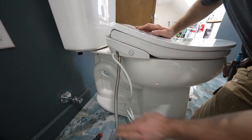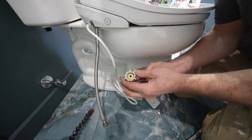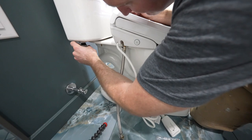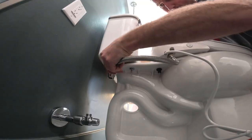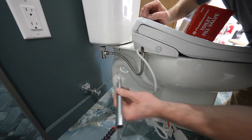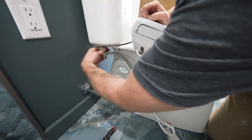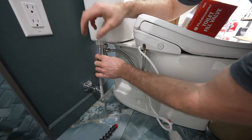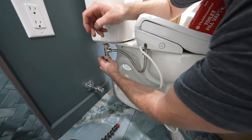What really makes it easy is this little T-valve. It's just like a regular supply valve to your toilet and doesn't require any Teflon tape — you can just thread it on like any regular valve. Hide this back underneath and go to hand tight, about a half turn past hand tight. You don't want to over-tighten these grommets. It does come with a 20-inch supply line, but as you can see, that's ridiculously long. I have another one that's just going to connect straight here. It has a little rubber grommet, so all I have to do is thread it on like a regular toilet supply.